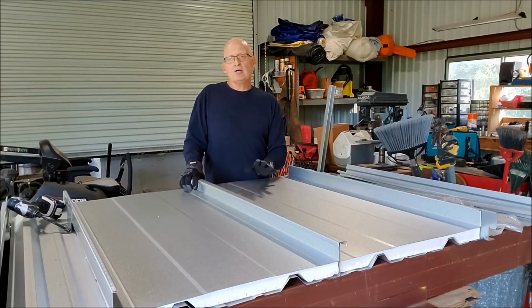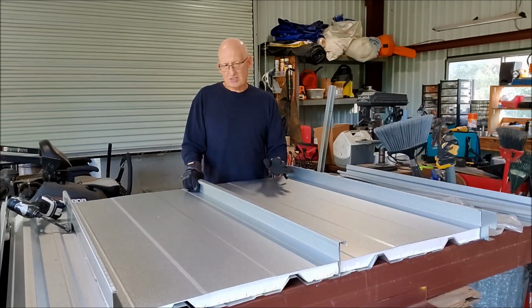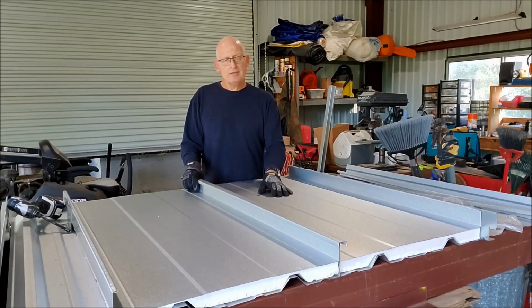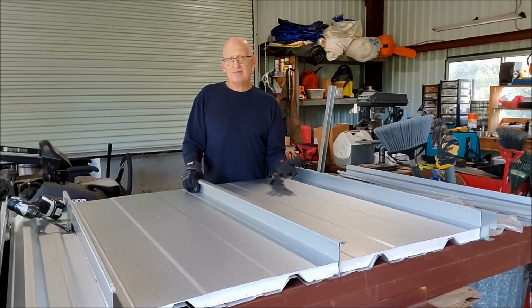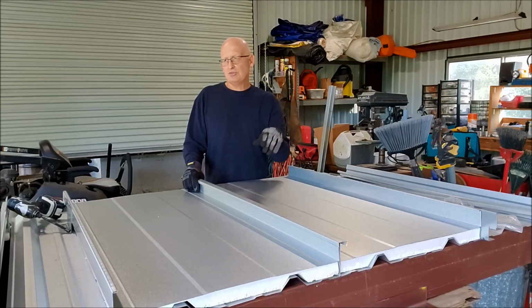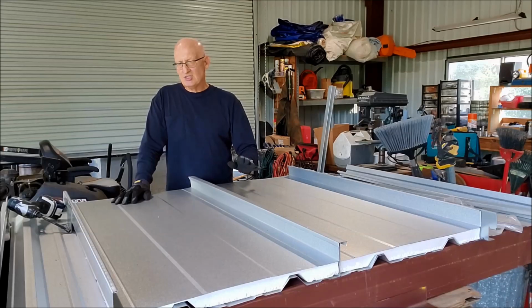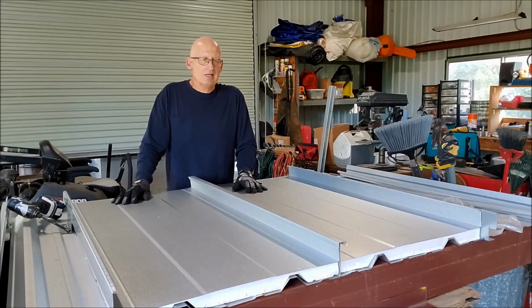We see this thing go down in the neighborhood of 1,000 square feet per man per day on these jobs. Great, fast installing system. Gives you individual panel replaceability. I don't think there's anything better out there for recovering an R panel, as long as they're not wanting to add a bunch of insulation and you don't have structural issues to start with. This stuff is going to be the lightest system, right at like 1.3 pounds per square foot is about where it's going to land.